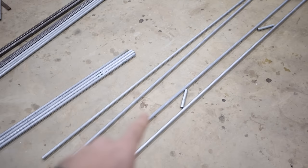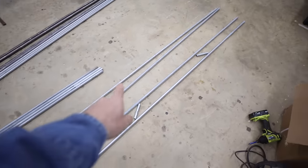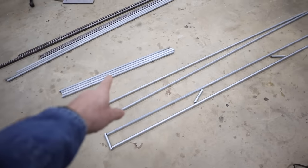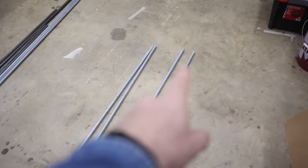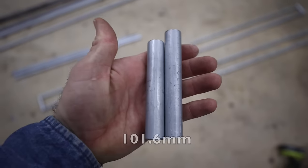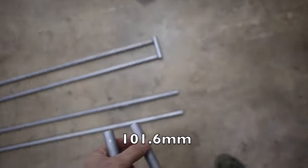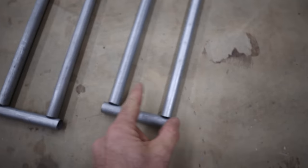I have four pieces of conduit cut to seven feet. I'm deciding between a triangular arm shape or a parallel shape — I'm leaning toward the parallel shape with maybe a slight taper toward the end. Using the off-cuts from the ten-foot pieces, I'll cut some sections to kind of make a truss. I've cut the two seven-foot pieces and then two shorter pieces — one is four inches and one is four and three-eighths. The four-inch piece goes on the outer end, flush on both sides, and the four and three-eighths piece goes on the bracket side where we need a little extra room.